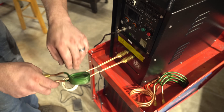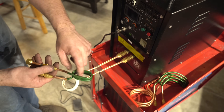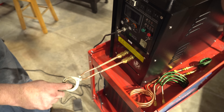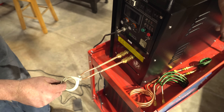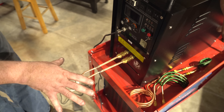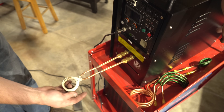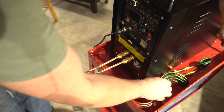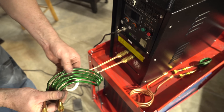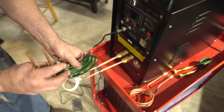Here's another one — this is just a box size. I got this one also for knives and for flat stock that you wanted to keep close to the coil. This one has some high-temp wrapping on it for protection. What does happen is if you take your work piece and contact more than one of these coils, it will actually spark, and that's really not good for the coils or the machine. That's why this one came with this coating. For the other coil I coated it in condursal — the high-temp paint I use for heat treating — and hopefully that will be enough insulation so a light touch won't cause it to arc.